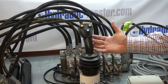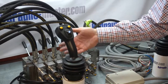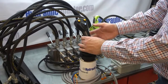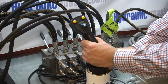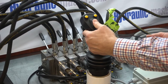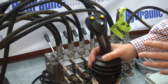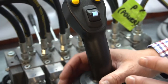This will give you a good understanding of what you're able to do. Each of these joysticks are able to operate up to four functions each. Of course, if you had an eight function system, these two joysticks can deliver the absolutely same operation. With the joystick here, we've got the forward and back function, the left and right — so that could be two different items you're operating. We've got the toggle switch and then there's two buttons. You can allocate each of these operations to whatever function you like, and a lot of this is down to personal preference or what you're operating.